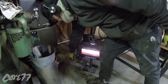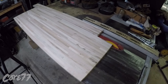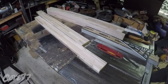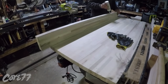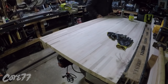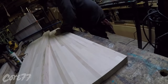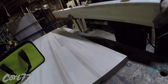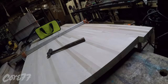Now here it is the evening — the snow is kicking up, so I turn on my forge, my little horseshoe forge, to keep the room warm. I'm ripping a fifth piece of 60-inch butcher block into 5-inch strips. Each one of those 5-inch strips is going to be added to each of the other four 60-inch wide tops, so I'll have a full 60 by 30-inch wide top — this stock only comes 25 inches wide. There you see it glued together with biscuit joints. I had to warm up the room so the glue could flow — it was about 15 degrees in there. I glue up all four.